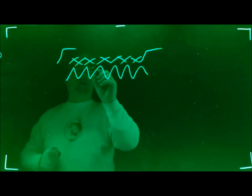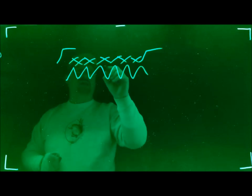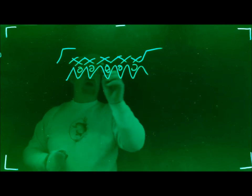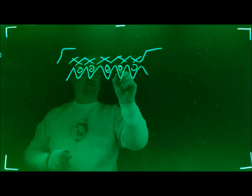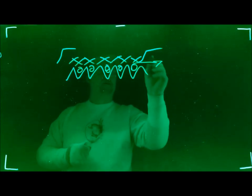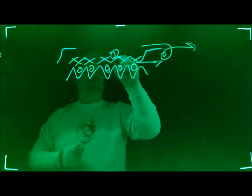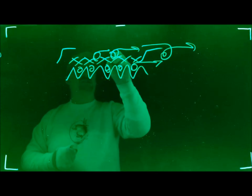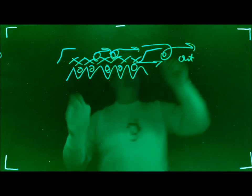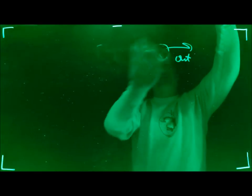And this clogged less than the filter media did, so we maintained more active exchange in these vortices. It allowed us not to cake over and allowed us fine gold recovery. But we were still losing quite a bit of gold because, again, all our vortices, even in the expanded metal, everything is going out. So basically, that was our favorite go-to little box that seemed to be pretty good.